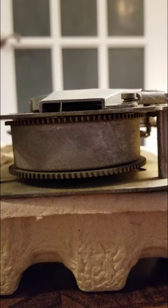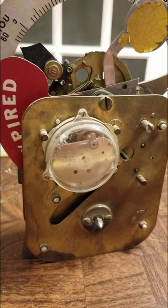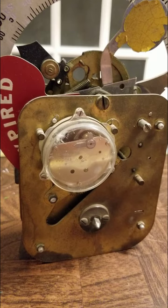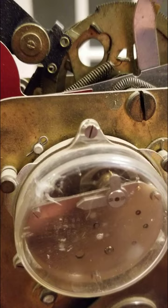So now let's take a look at the mechanism behind this. I'm going to push in a nickel and let's watch the spring advance. Pretty cool. Now that the spring has set the time, the pressure from the other side of the spring is driving this clock. So literally the spring is running two things simultaneously. If I zoom in here you can see the little clock in here just ticking away.